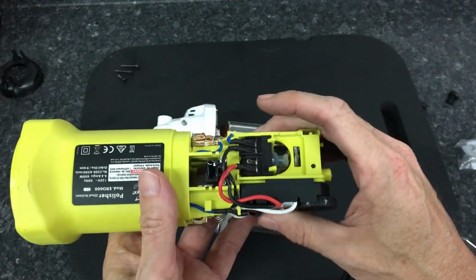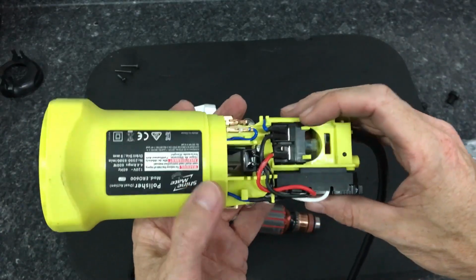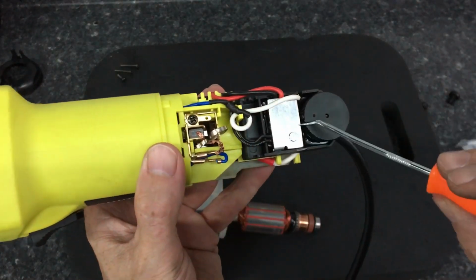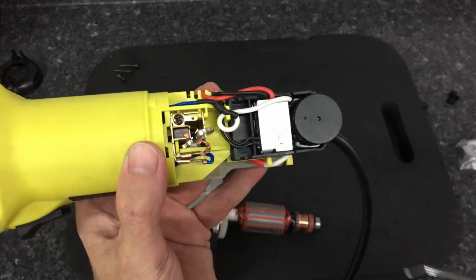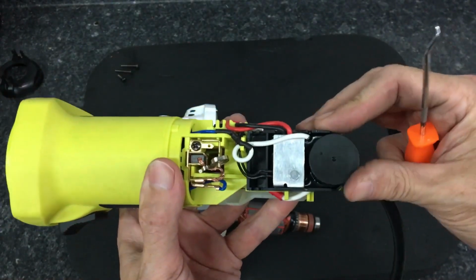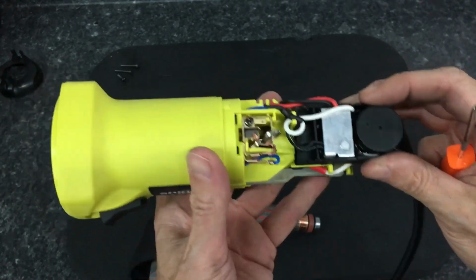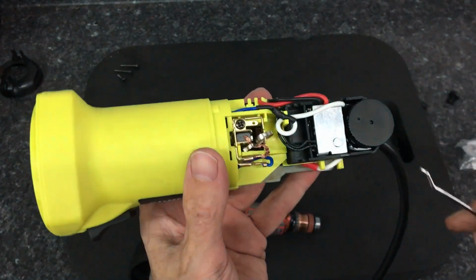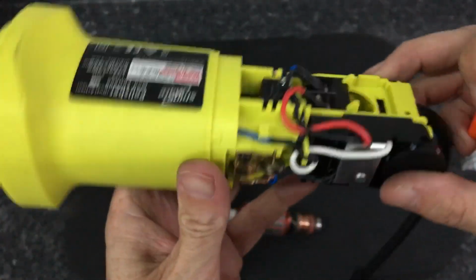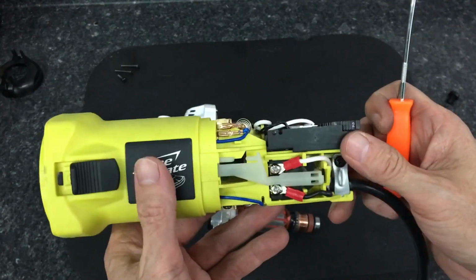The business end of the polisher is looking good as well. Nice clean wiring with shrink-wrapped spade connectors. The PCB board down underneath this plate here is coated, which fights moisture and dust. Again, I wish there was some tactile feedback when it comes to the speed dial itself. The brass encasings for the brushes and also the coil spring holding them in, everything seems to be fine. Everything is looking good so far. The standard 8 amp switch as well.